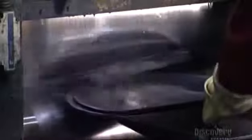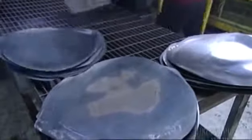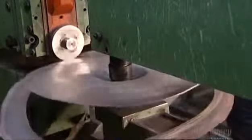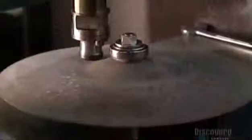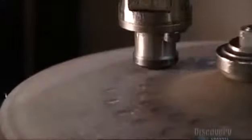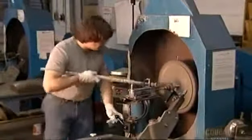The interlocking weave also helps transmit sound waves more rapidly across the cymbal. After the cymbal has been tempered and pressed into its final shape, they place it on a spindle. While it spins, circular cutters shear the edges to a set diameter. Next, the cymbal takes a pounding — a hydraulic engine powers a hammering cylinder, and a computer program directs the force. These impressions enrich the cymbal's sound by changing the path of the sound waves. Then it's time to start grooving, as in tonal grooves.